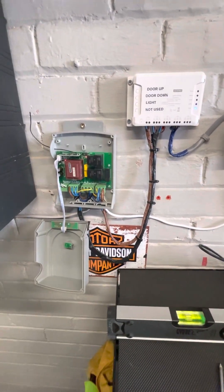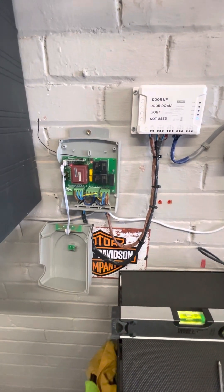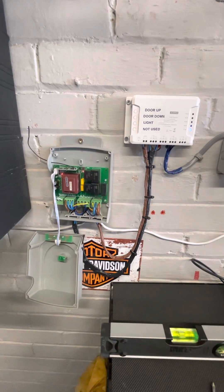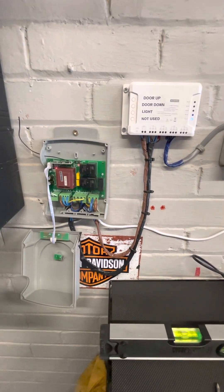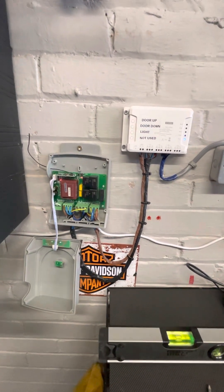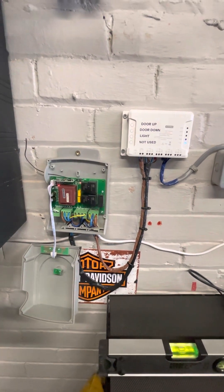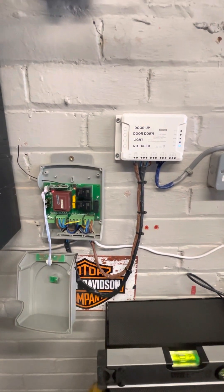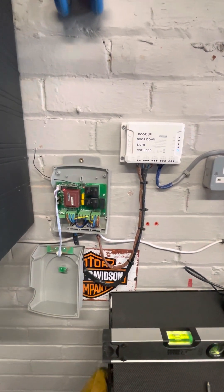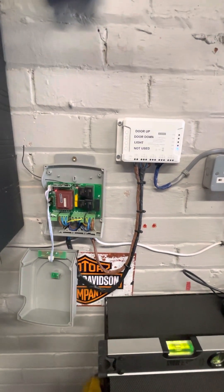You'll be able to operate it up and you'll be able to operate it down. To use the door-down button for it to go all the way without you having to hold it, on the app when you download it you have to go into inching settings. I was timing the door — how long it would take to go down with my finger on the button on the original settings — and I think it was about 40 seconds, so I gave it a couple of extra seconds and used that in the app.